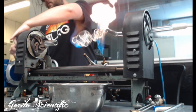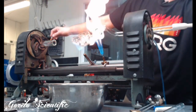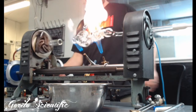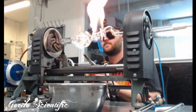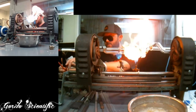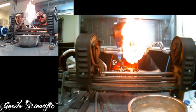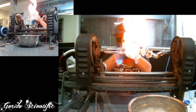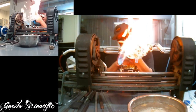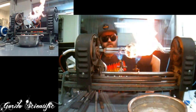We've already got this prepped up and ready to go — just need to get a blow hose on it. I'm going to let it soak in the flame for a little while. I now have air on both sides so I can blow out the seal evenly. If you only have air on one side of this seal, it tends to want to blow the membrane whichever way the airflow is — so if I just had air over here it would blow the membrane into the foot. I prefer to do it this way; it seems to be the best way to do the seal.